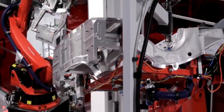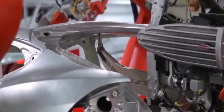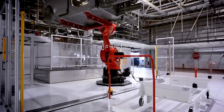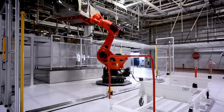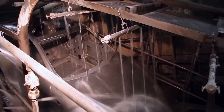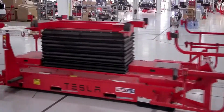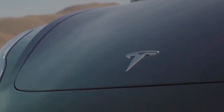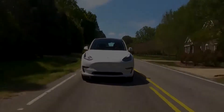"You can muscle through it, and we have," Musk remarked. "It is way better to have a single-piece casting. You don't have gaps in the sealant. You don't have dissimilar metals. You can reduce the size of the body shop dramatically." So why didn't Tesla just build the Model 3 and its other EVs using such castings sooner? Because sufficiently huge die casting presses were not yet available.